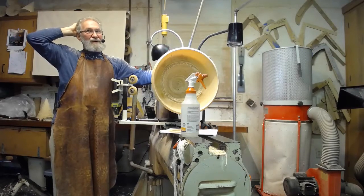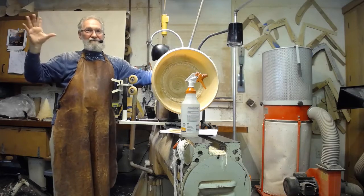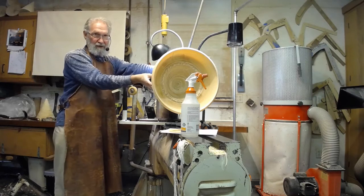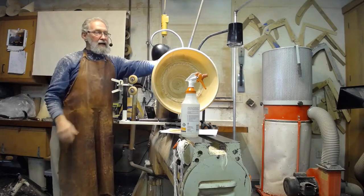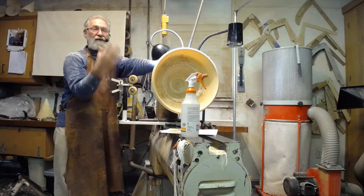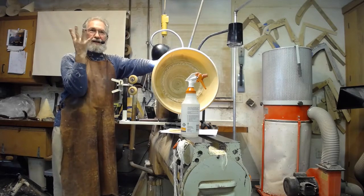It's not like you have to wait, like when you do twice turn bowl turning and you have to wait 6 months or a year or whatever. This is so thin and there's so much end grain involved, they dry very quickly. I usually put a blanket over them for the first day, exposed to the air. Then, no matter how smooth I got it on the lathe, I have to do a fair amount more sanding, because they get fuzzy, the grain raises.